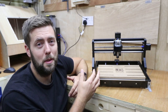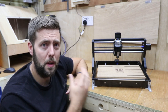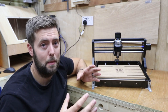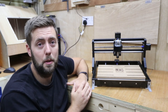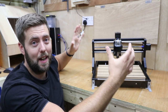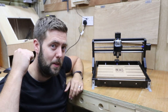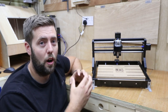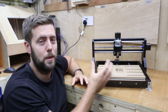For such a small machine, one of the biggest complaints is often how noisy it is, and the majority of that noise is down to vibration. One of the first options is simply to enclose the machine, which physically reduces the noise you're hearing. I built an enclosure — there'll be a link with the plans if you want to download and build your own. But I've seen more creative ways, like simply putting clear container boxes over the top, which reduces noise and contains dust at a much cheaper and easier option. The other two options are reducing vibration transfer to work surfaces, or reducing vibration in the machine itself by tweaking a few things.